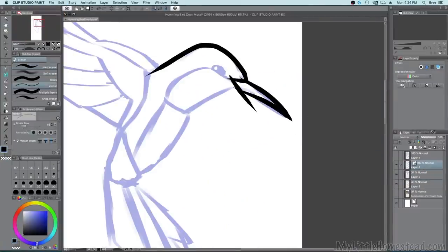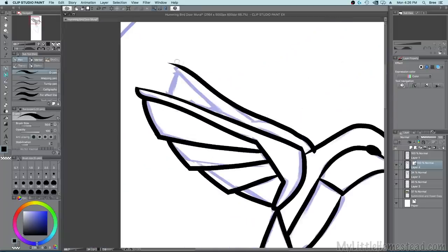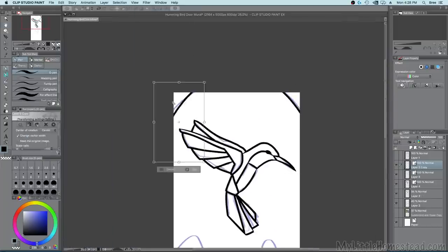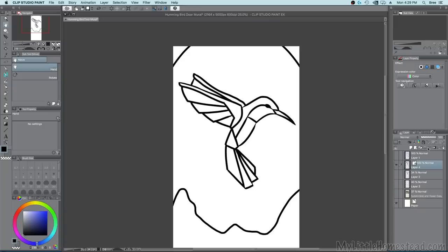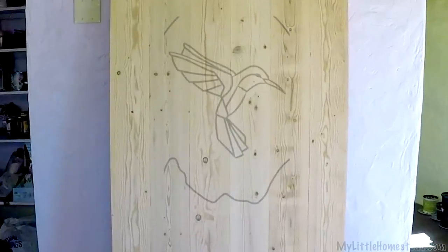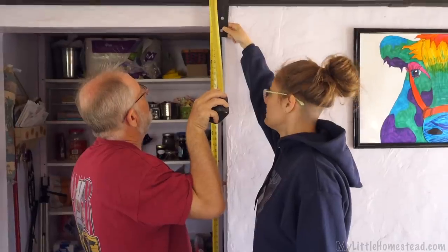It looks like we're getting ready to put in the plan for what we'd like to do for this door. I've finally settled on what I want to do — I'm going to be creating an epoxy stained glass look. I'm going to draw it on my computer and then fill it all in. I'll use epoxies and outline it in some kind of caulking. In each of the shapes created for our stained glass, we'll pour the epoxy — so you're building dams around your shapes and pouring colored epoxy in. The dams stay there forever. It's all going to be done in one pour, leaving at least a minimum of an inch, and then we'll fill up the rest with clear over the top.